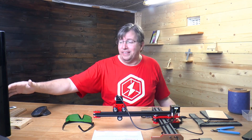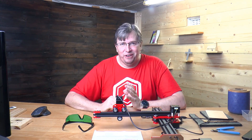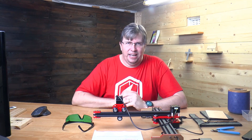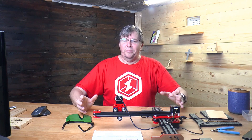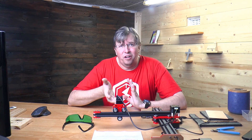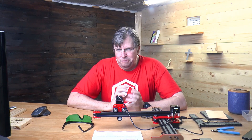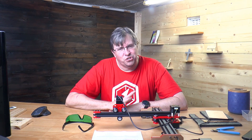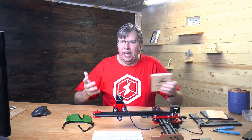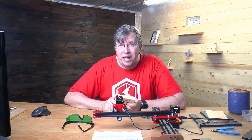I want to show you some of the things that we cut. I can't find my very first cut anywhere. What happened was I nearly set the house on fire because I set the laser to 30% and was cutting something under a box. When I took the box off, smoke was pouring out because the cardboard had caught on fire. I only had to drop it down to 12–15% and then it was etching cardboard easily and nicely. You have to play with your settings. I wanted to get some balsa wood — that modeling wood you use to make model planes — but there's no stock in Durban, South Africa.